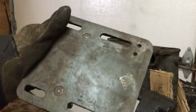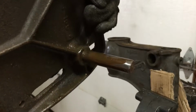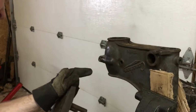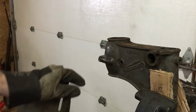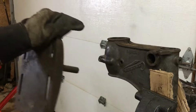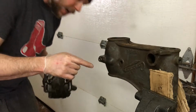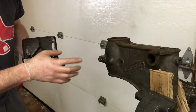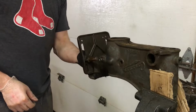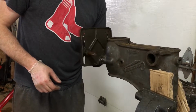So I just got the motor mounting plate out of the back of the head. You can see there's a lot of gunk and stuff, but on this side you can see someone has ground that down a bit, just in a few spots. I guess they were having issues with it fitting in. But either way, I've not finished drilling out this side. It's mostly done. What I'm going to do is chase back in before I clean this up, or probably after I clean it up with the sandblaster. Yeah, probably after. I'll chase this back in with something that's a little larger, and when I land on a final diameter, I should then be able to tap this out. I'll drill the other side to make it the same, pick up 2 identical thumb screws, and that way we'll have something that we can use going forward for adjusting the belt tension via the motor mount.